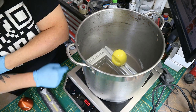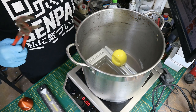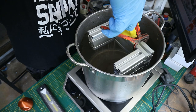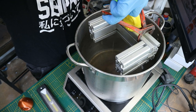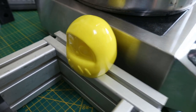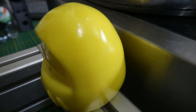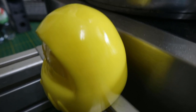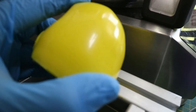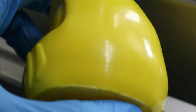This is to prevent all the vapor spilling over the edge due to too much vapor collecting inside the stainless steel pot. Acetone vapor is heavy and will stay in the pot if the heating is correctly tuned low like this. I then set the timer to two minutes and let it do its thing. When the time was up the induction heater shuts down and I used two grips to lift the whole thing out and let the piece harden.